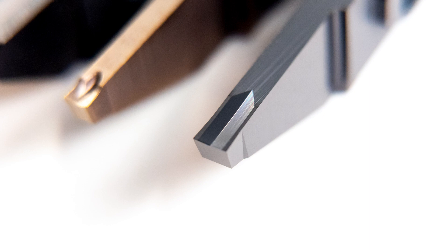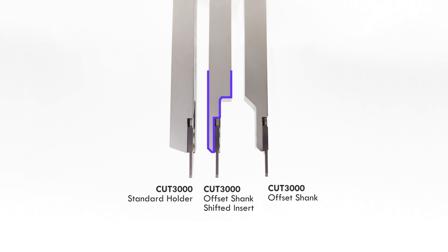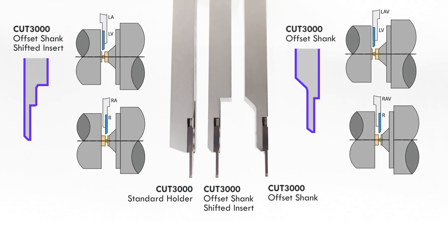Another strong point for the Cut 3000 Series product line is cutoff. Given that the insert blanks are made from a very long piece of carbide, there are a lot of options for cutoff. Cutoff can sometimes be tricky depending on the application — you may have clearance issues with the guide bushing or pickoff spindle, or need to get the insert down in there to separate it from the workpiece on a short part. There are holders available with offsets built into them to clear your work holding, allowing you to get the insert in to cut while having the support you need. So you're able to deliver the carbide to the part as needed in an interference-free situation — lots of options to solve those kinds of challenges.